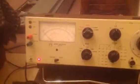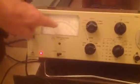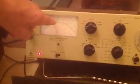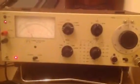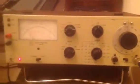Okay, now what I'm going to do is show you what the noise floor is. We've got everything wired to a Potomac AA51 audio analyzer. This is a broadcast standard audio device. 1, 2, 3, 4. As you can see, I'm hitting roughly on the peaks about a -6. I'm on the +10 dB scale, so 10 minus 6 is a +4.